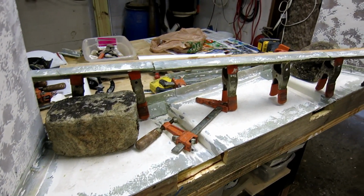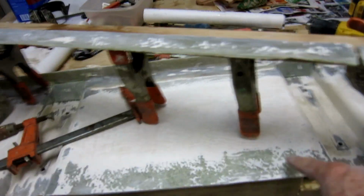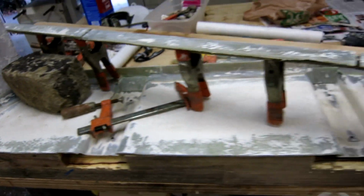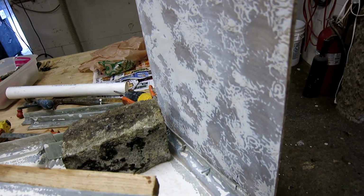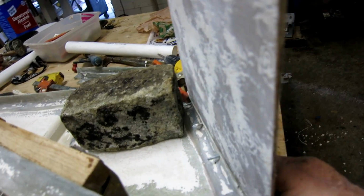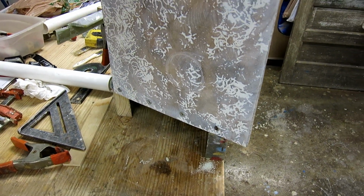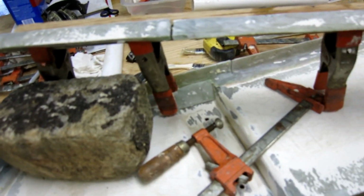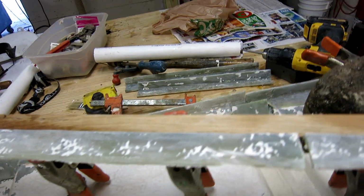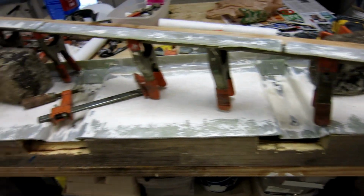Alright, we have an ambitious glue up this morning. I'm going to glue these angles, which are held straight by this board, to this back of the box. I didn't do them yesterday like I said I would. I'm going to glue the 2 end panels in place, and I'm just going to temporarily screw them at the bottom because I don't have a way to get a clamp on them. These are the ones that I doubled up and weighted down with the battery for a clamp. So they're pretty stiff now. And I'm going to glue the little closure pieces down by the toe space. I didn't want that support to be vertical. I want to kind of kick it back just for aesthetics.